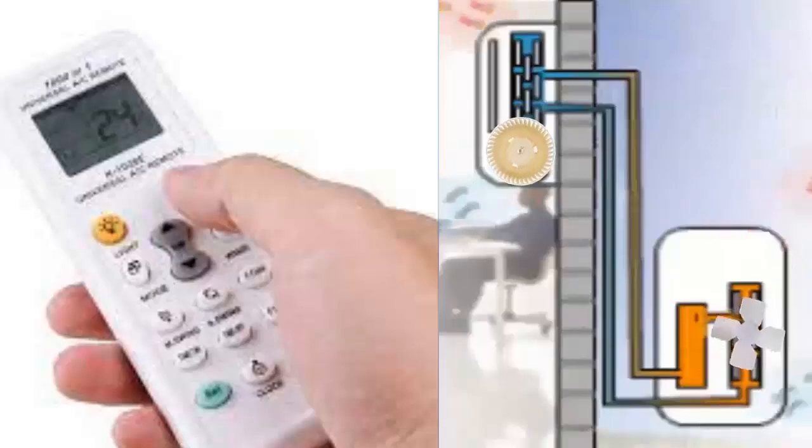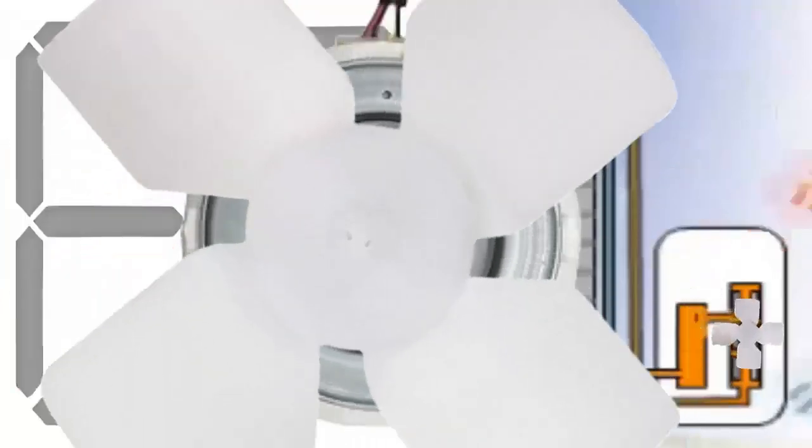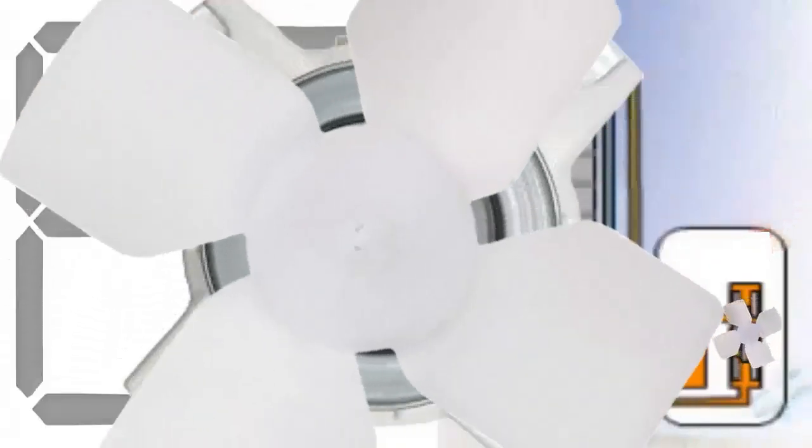4. Check the cleanliness of the fan and coil of the external unit to ensure the unit is in optimal condition. Remember to visually check the proper rotation of the fan. With the unit off, make sure that the fan blades rotate freely to rule out mechanical problems in the fan.